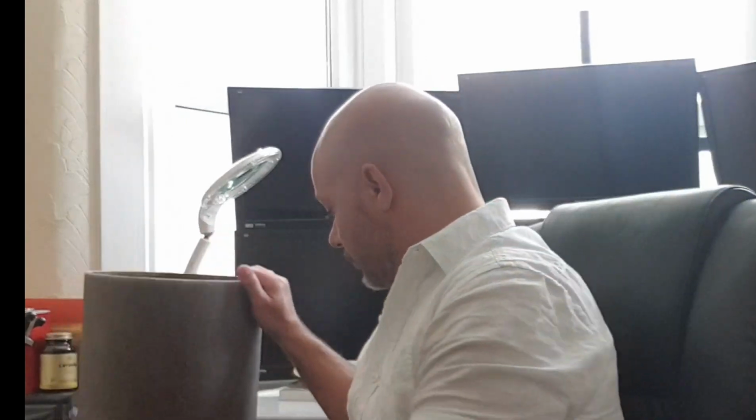So I'm going to be using this tube which I made. This is a 1 meter long tube. It's just over 10 inches in diameter, but the actual mirror I'm going to use is 8 inches. But I need space within the tube just to make all the brackets that are going to hold the back mirror in position, the primary mirror. So I'm going to show you how I made this tube. It started off as a cardboard postal tube, and I basically reinforced it with fiberglass cloth and resin. So I'll talk about that.